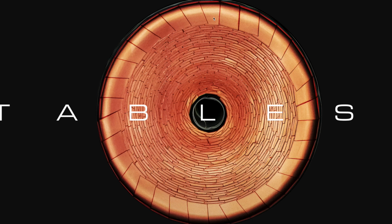Previously, in a lithium-ion battery, you might have this roll here, which contains all of your battery materials, without going into too much detail about it. You'd have one tab from one end of the battery, and then on the other side, you'd have another tab from the other end. The big advantage to having this tabless design is that it allows you to make much larger batteries, because the current doesn't have to flow around and around the spiral to get out. It can now just come from one end of the battery directly to any one of these tabs, whichever it's closest to. That's going to dramatically reduce the internal resistance, which is a great thing to have for your battery. Anyway, the question was, how are they making all these tabs?